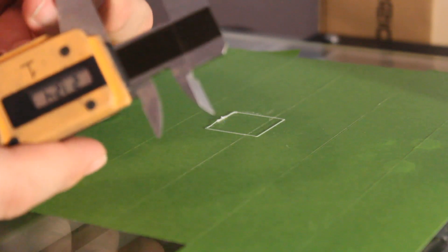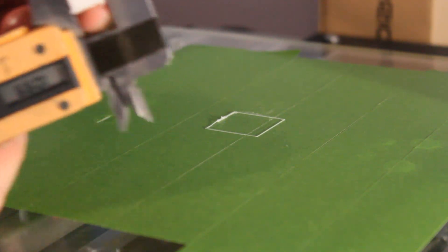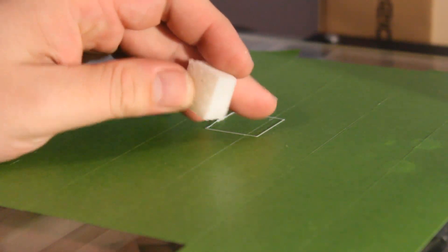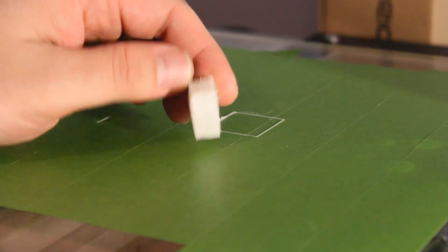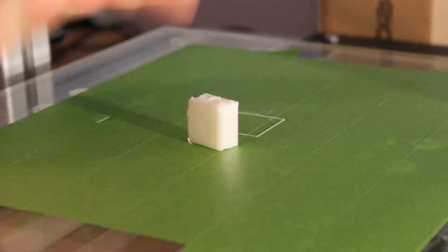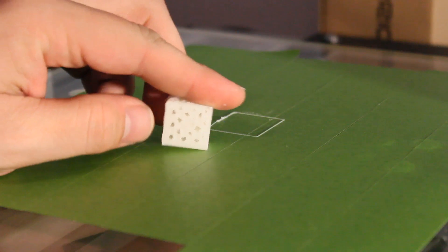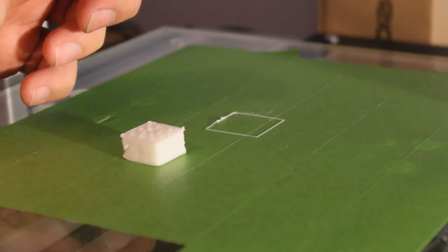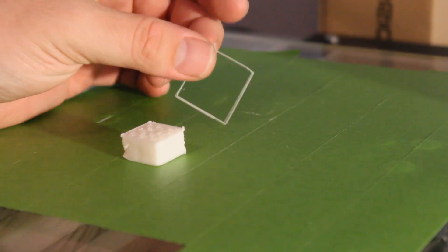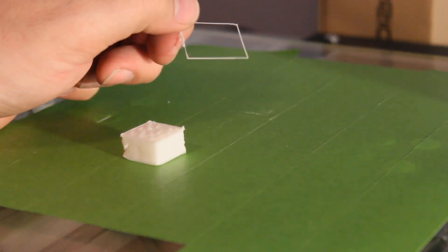20 and a quarter there, and 10.89 there, so it's not quite in dimension yet. But obviously I've got the steps per millimeter dialed in. I've got all the Z-stuff working well. It's not terribly lopsided, so it's coming up evenly. It's not a parallelogram, so that's pretty good. I'm happy with that. I'll play with some feed rates and work on this heated bed sooner than later, since I'm not going to hold the heat gun up to it every time. Since I have a nice bed heater that I always planned on using, I'll go ahead and get that wired up now.